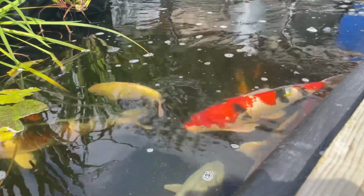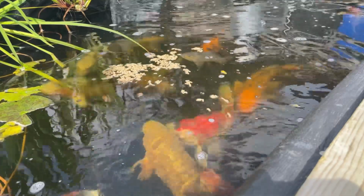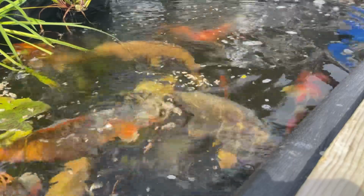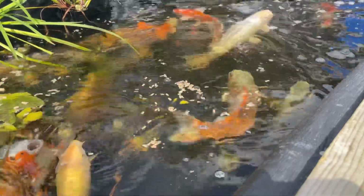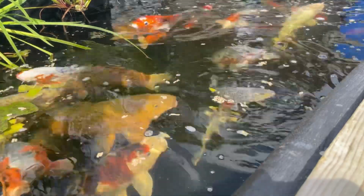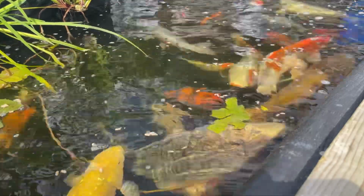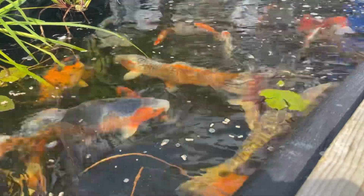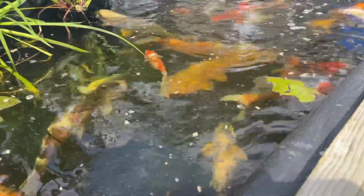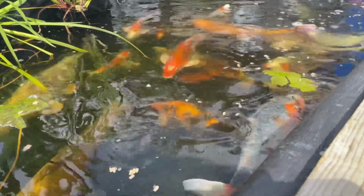So what we've got planned for today is, on the main pond we have our 3-inch return. Fortunately now it's just a quick little bodge job just to get the filter up and running. There's nothing supporting the rear flex rubber reducer, so we're going to look into changing that area today to 2-inch, just so that we can make sure it's all solvent welded and all solid and shouldn't have an issue before a problem arises.